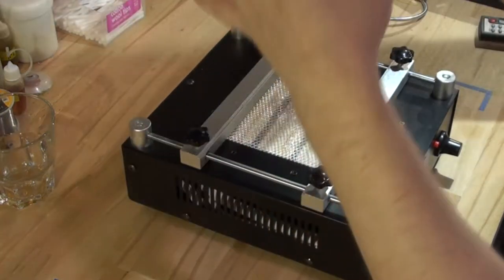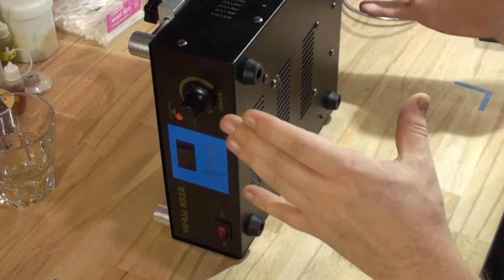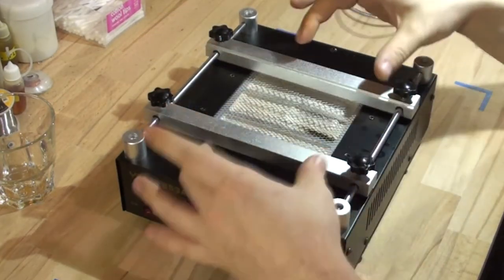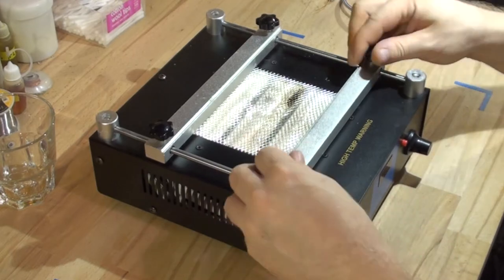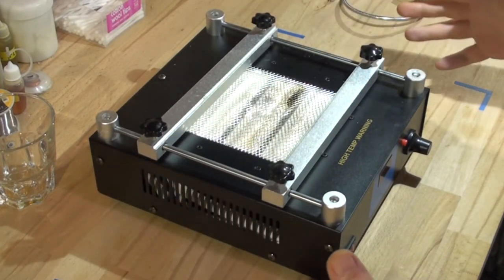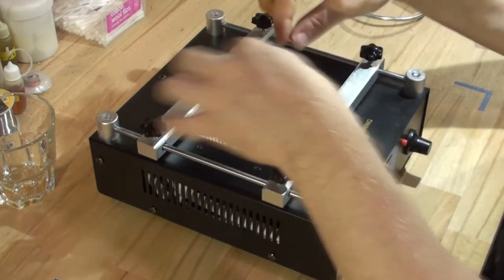I'm going to have a top element as well, which I'll go over in a second. I've bought another one of those stations — except it's a hot plate one — and I'm going to use the bottom part and attach them together. This way I have space to build the controllers inside, because there is no space inside that one for a proper controller. I will also be removing the existing mechanism and extending the rods to make a separate table that can slide out from the station, so once the board is desoldered, you can move the table out and remove the chip.